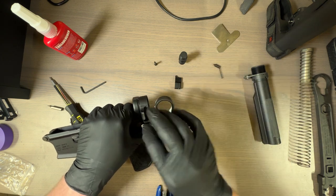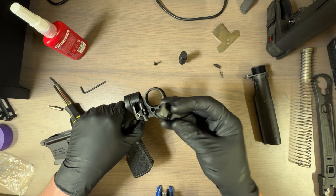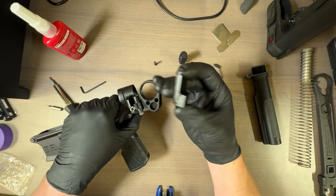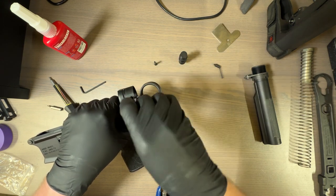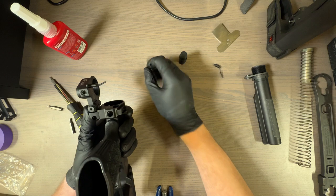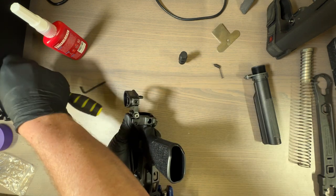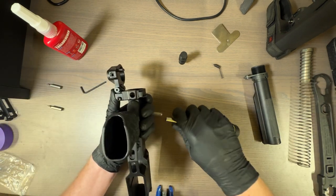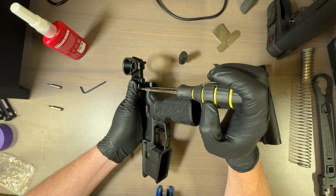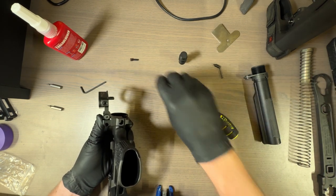This little guy goes first, then the spring down here in the bottom where there's a little hole, then the wide piece down at the bottom — just like that. Boom. Flat face against the spring. Press down and hold that there, because then we have to drop this little hex bolt back in, and we'll need to switch back to the 9/64ths bit. This one I kind of do want to put Loctite on — it's kind of an important part.